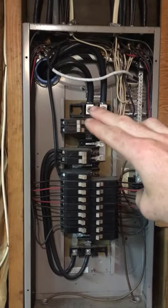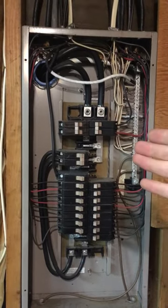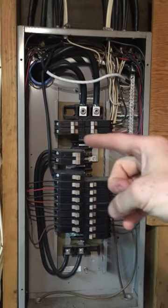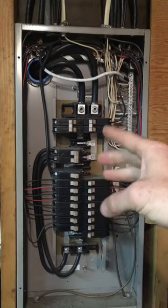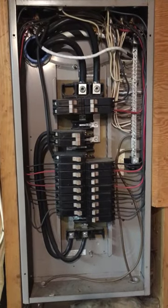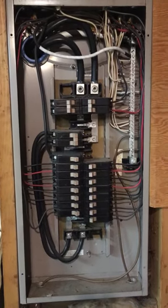There's no main shutoff. Most newer ones will have one main breaker shutoff. It's just good to know with this style that it requires more hand movements to shut off the power. That's just a good look at a split bus electric panel — thanks for your time.